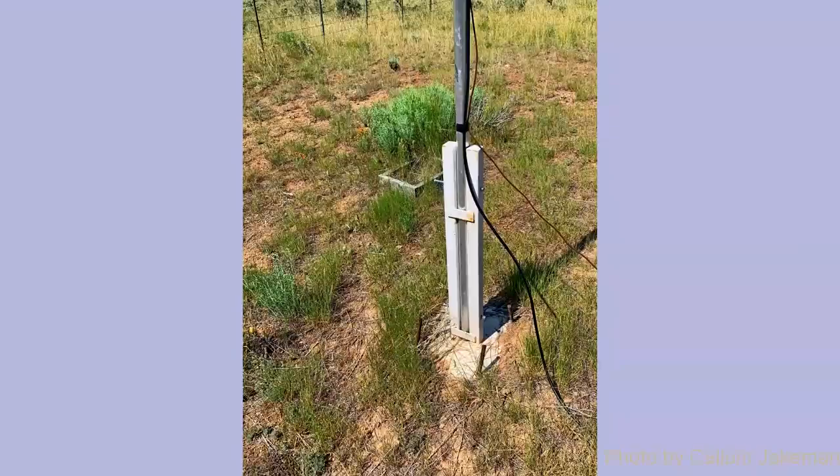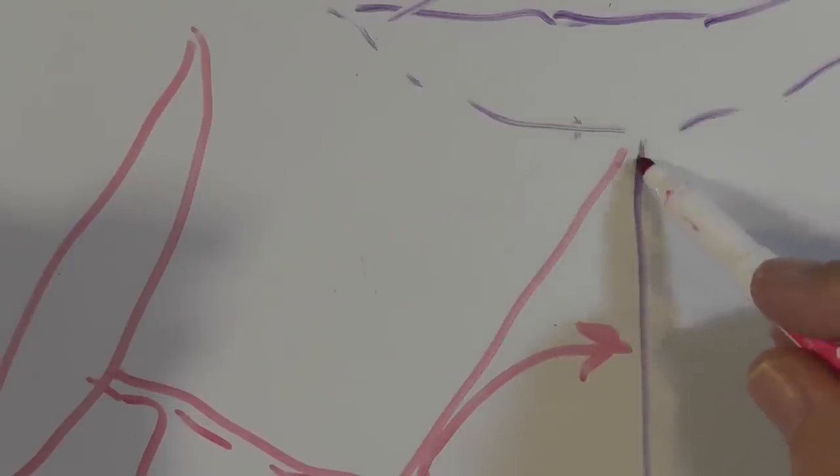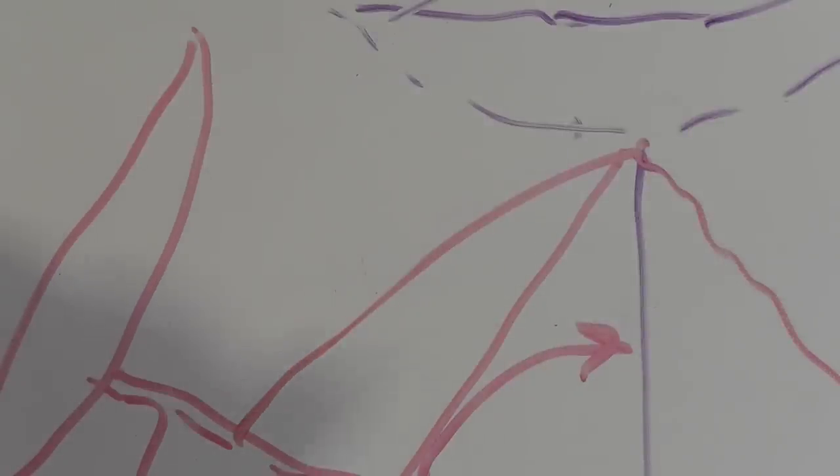The way I have mine, there's a somewhat overbuilt structure at the bottom — a steel plate about one and a half feet across. The vertical part goes up about three feet, with a pin here and a pin here to hold it down, and then four stakes go into the ground. This allows you to have just one pin in place and walk the mast up. It takes either someone very strong or two or three people to walk it up. It's nice to have your guys already measured and in place with the guy ropes loose, get the thing up, tie the last guy rope, and you're in good shape.